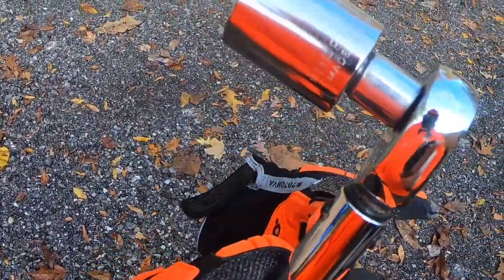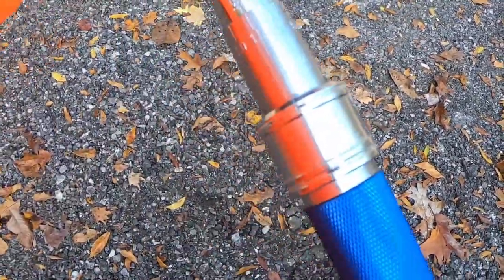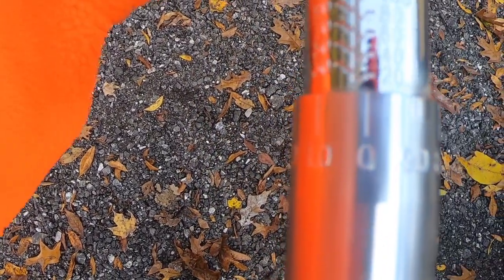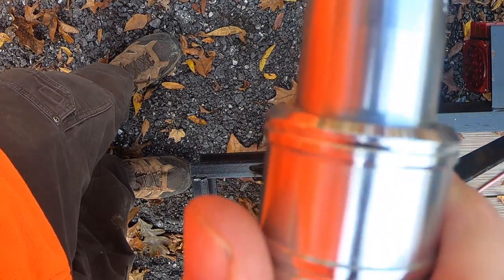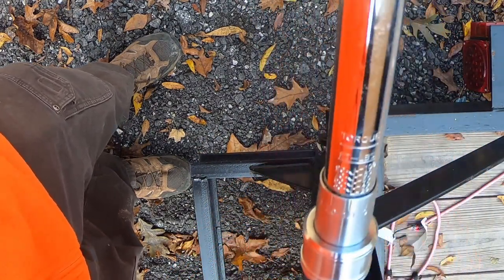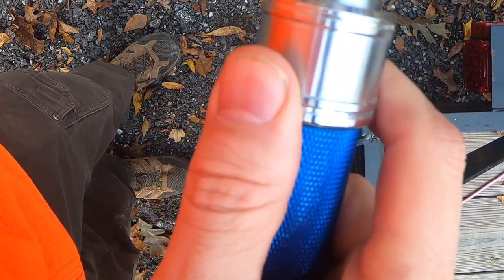Alrighty, something else I'll show you. I tighten the blade with this 1-inch socket and this 3/8 drive torque wrench. And it's an old school type with the, I think it's called vernier caliper measurements. So I know they use this on micrometers also. So the line there that has the 20, that's what you want to go to. And you spin this dial, which you have to pull this back on this particular one. This is a Cobalt. They sell them at Lowe's. It was their store brand for a while. I don't know if it still is, but anyway, pull that back and then turn this until this sleeve lines up with that 20 mark at zero.